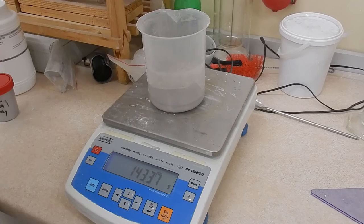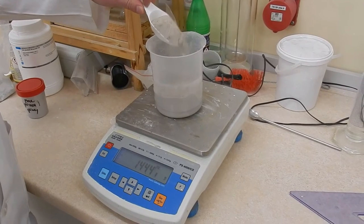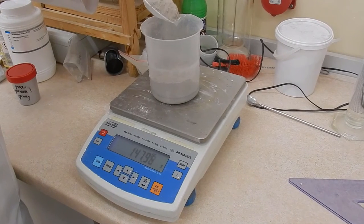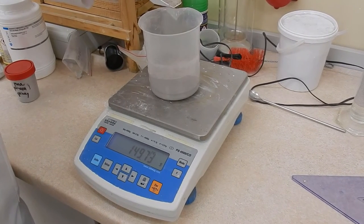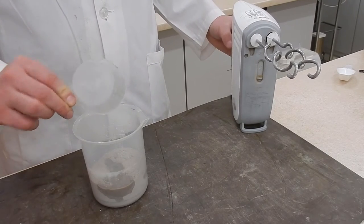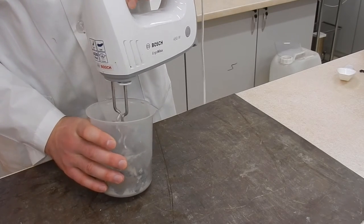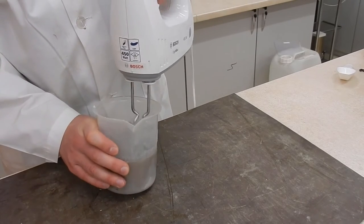The next step is forming process. Fired clay, granulated blast furnace slag and a solution of sodium hydroxide are sequentially weighed. To a homogenized mixture of clay and slag, a solution of sodium hydroxide is added. The components are mixed by a mixer. Sodium hydroxide is the activating component.